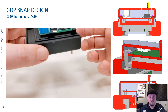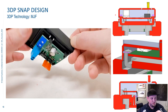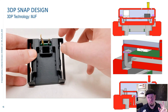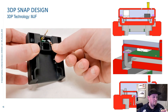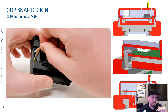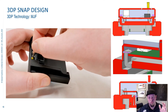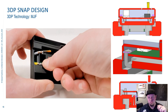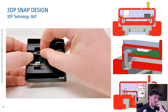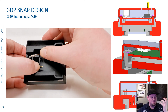I'm lining up the PCB board with three retainer pins, then pulling these snaps back and snapping each corner of the board into place. The board is now in place and those snaps are retaining it. You can also see a section view of those snaps. All of these are designed to be one-way snaps — you can make these really complex enclosures that you can't easily get back open again. In fact, that wall right there is actually broken on this model from me trying to take it apart to show you.